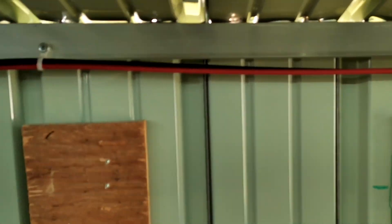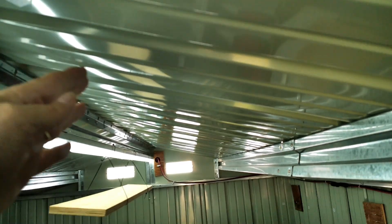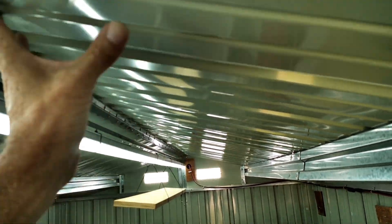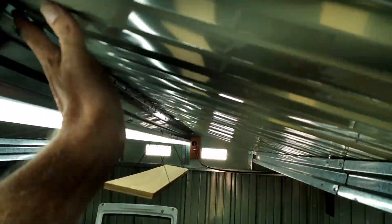On the roof panels you can see right here the screws coming down — these are the roof panels screwed directly into the aluminum frame of the shed. Coming down further you'll see another one holding that panel, and then another set of screws holding the next one. I wanted to show on the inside where it's supported. The top section will be along this ridge, and I'm planning to do the same thing I did with the wall — put a support piece of wood to distribute the weight and capture this internal ridge line where all the massive support is.